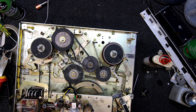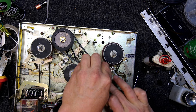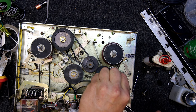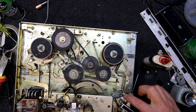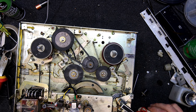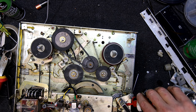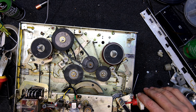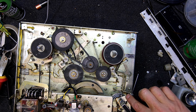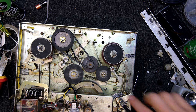It's actually pulling down a bit — well, that's only a guess. It probably just simply puts a brake on the reel. That's it on there. Am I going to lubricate that? I think a bit of oil on there won't hurt. That feels a lot better — and probably on this bit as well. And down below — a bit more oil. I would normally wipe some of that off, but that risks running down. Yeah, that's way too oily — I've actually splattered a bit. I'm going to have to clean that off. Don't want oil on the rubber bits.